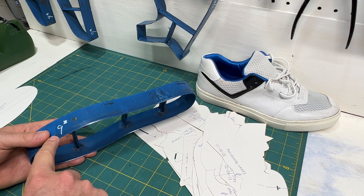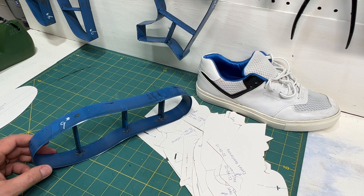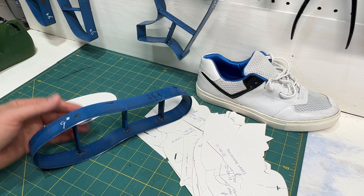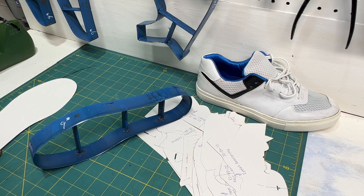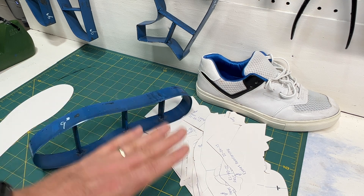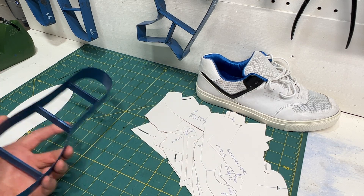You've got to mark it with the size. If it's a high-volume shoe in a production setting, you'll have a left and a right. You could theoretically flip the material over and use the same cutting die to make the left or right side, but generally you don't want to do that. Generally you're going to have one set of each because of productivity. So you'll take this and put it into a cutting press with a cutting mat — that's how you'll cut. That's the bottom.